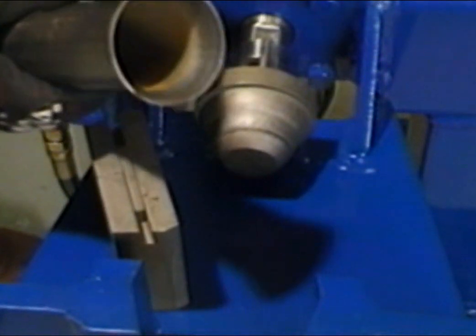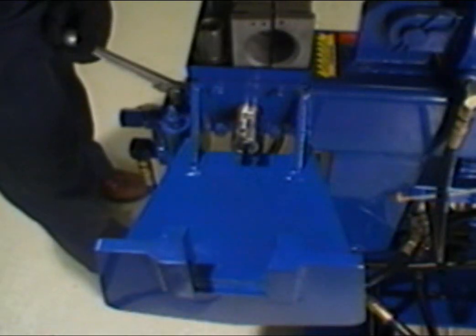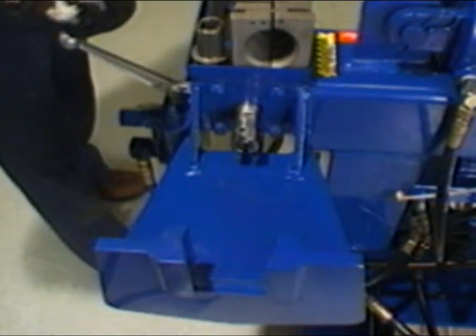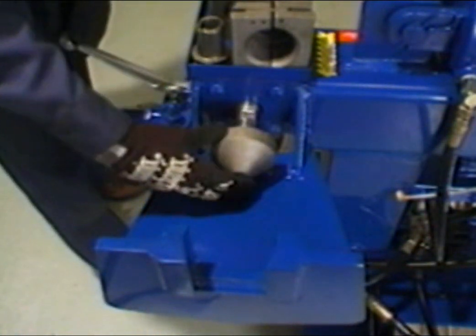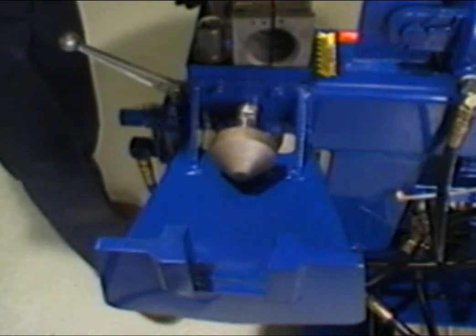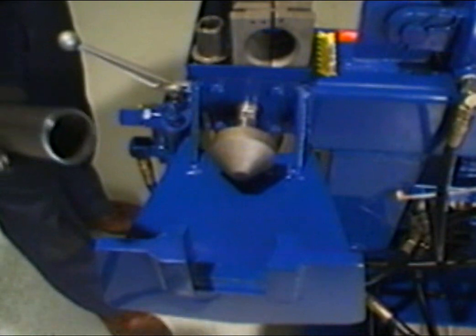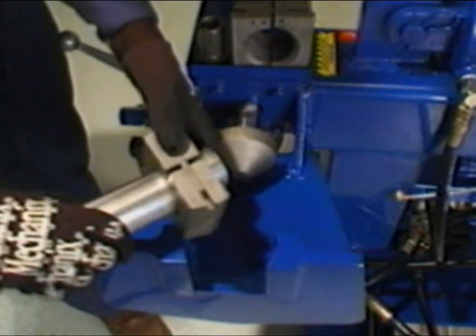The HPF 300 tool and flattening plate is used to make 45 and 90-degree manifold flares. For demonstration, we'll form these two different flares on 2-inch tubing. To begin, retract the swagger cylinder completely by lifting up on the valve handle, then install the HPF 300 tool on the cylinder adapter. Install the required collar around the tubing and position within the clamp blocks.